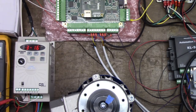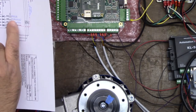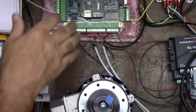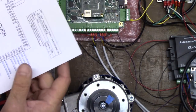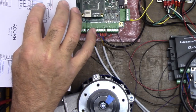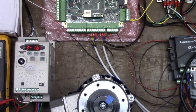We'll get another jumper and wire it from the drive to an input. We're not going to use drive okay, because drive okay is being used — that's input 5, and we're using input 5 for closed loop stepper drives. We're not going to use a probe on the lathe, so we can use input 6 or input 7.